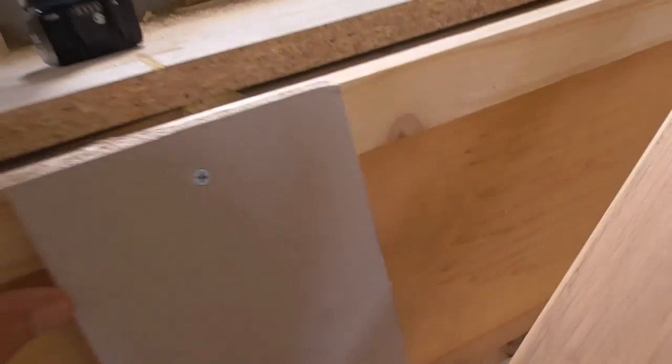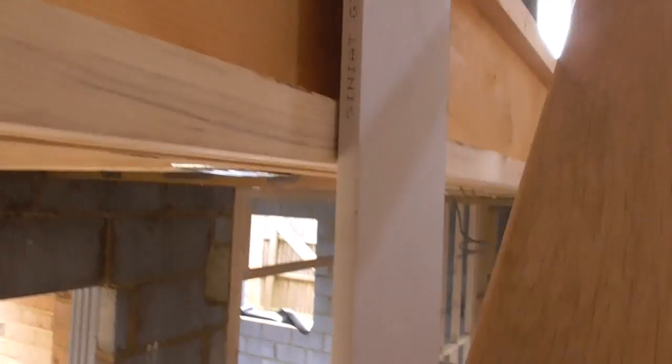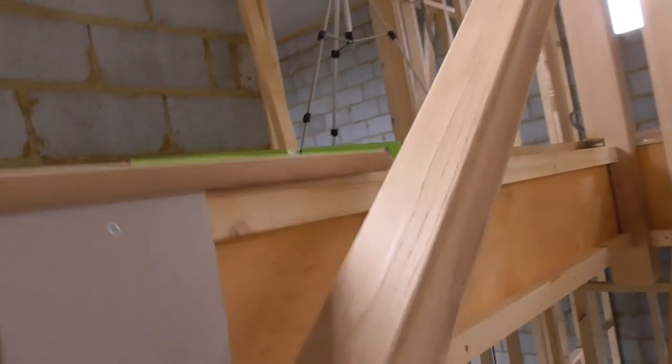All that's going to happen now is when the tacker comes in, they'll tack this ceiling through here, carry it on up round. I'll get them to leave it slightly long — you can see I've sort of mocked a bit up here. So the plasterboard will come up here, leave it slightly long, and then simply all I'll do is when I fit my capping, look — that capping fits straight over it. As you can see from under there, that leaves a lovely clean detail straight into there.